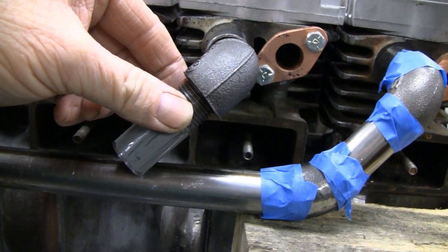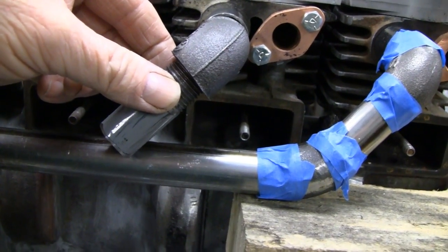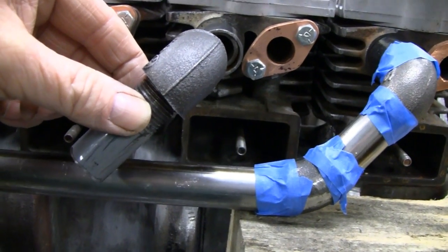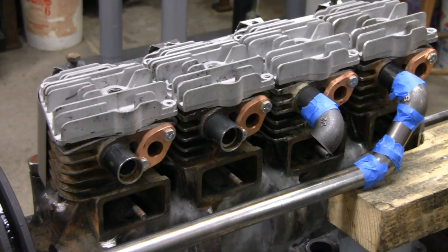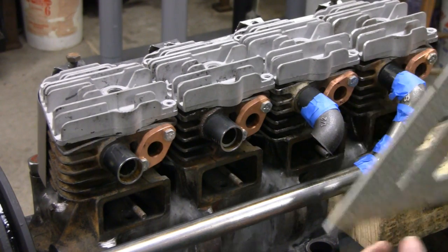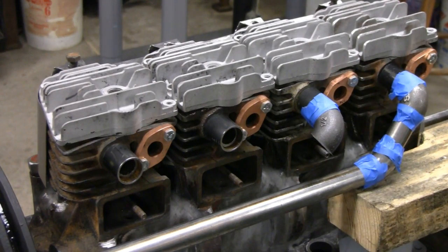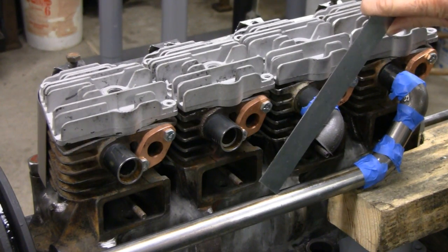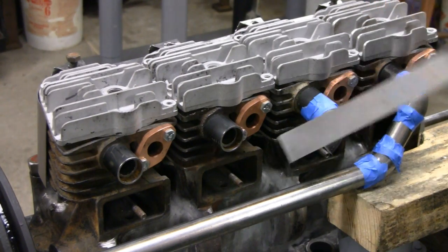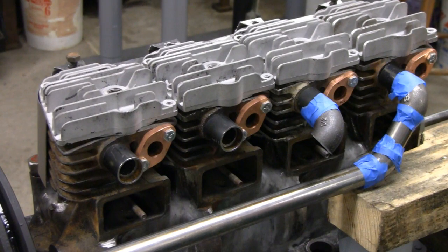Now I've got to determine the measurement to place the second pipe. It's a bit tricky because it's on a 45, but I need to see exactly where it's gonna land and where I need to put it on an angle. I also want to fish-mouth it so it fits snugly on that pipe. These pipes have a line on them which helps a lot — it looks like about two and a half inches to the far end, so I'm gonna make them three inches and cut the excess off. Once I determine the exact size, the other two will just be duplicates.